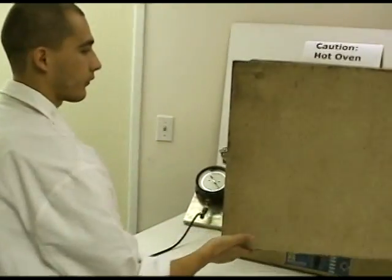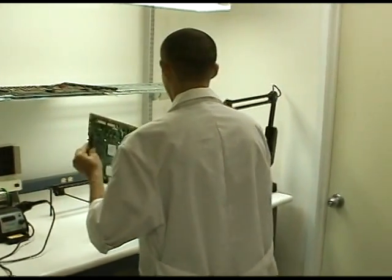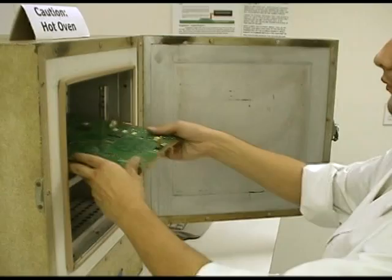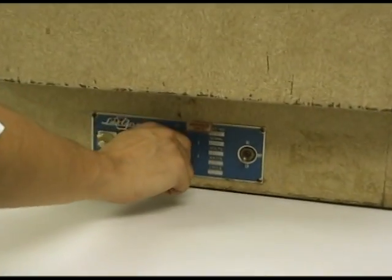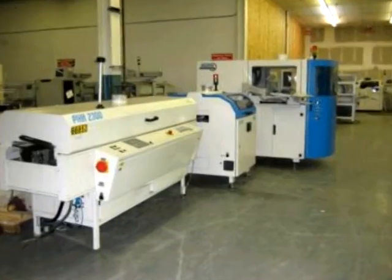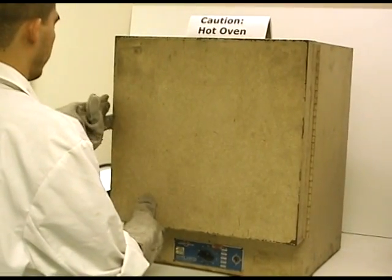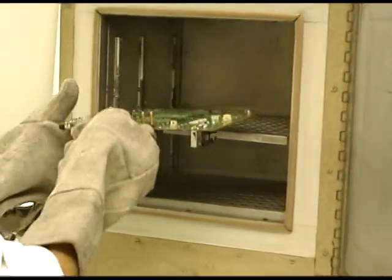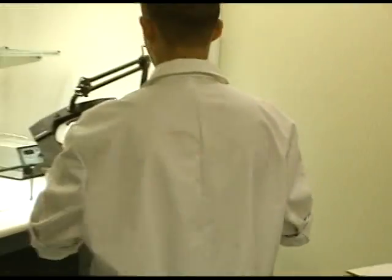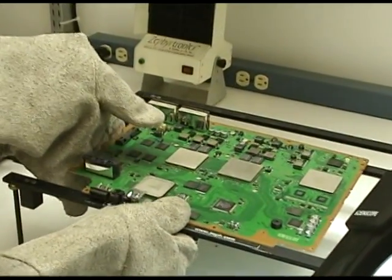The first preheating method is the oven. If there is an oven in close proximity to your bench, then the use of an oven to preheat your substrate during low volume soldering, rework and repair, or even in prototyping, can yield uniform temperature profiles because an oven will warm both the top and the bottom of the PCB assembly, just as conveyor ovens or the popular wave solder machines do. Since one cannot perform soldering and desoldering tasks while the PCB is heating inside the oven, the technician must transfer the hot PC board back to the bench, which is awkward and requires high-temperature gloves and other precautionary methods. Even more problematic, the PCB begins to cool the moment it is taken out of the oven.